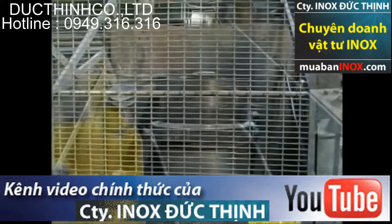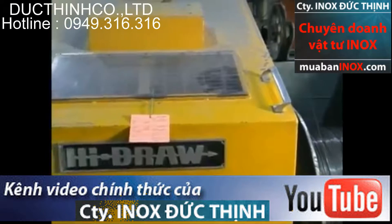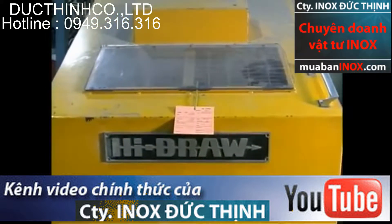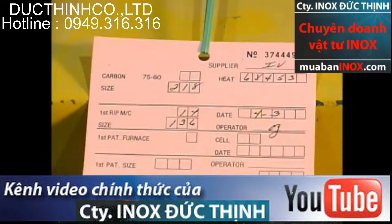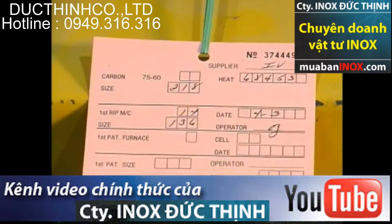The rod could be drawn to an intermediate size using a ripping machine. The intermediate process wire is tagged with the appropriate information and is then ready for the next step. This identification is part of Bryden American's ISO 9002 quality system and requirement for traceability.